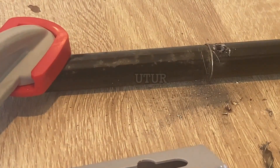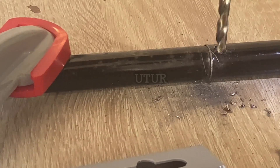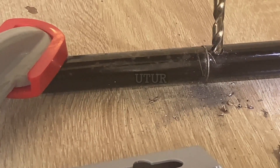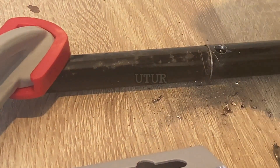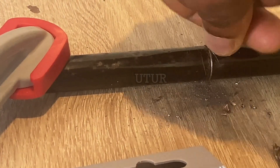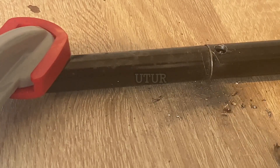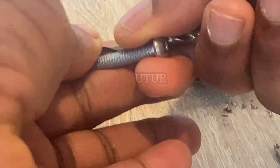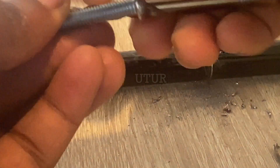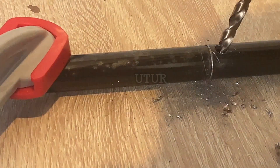This is the 4mm drill bit, then the 5.5mm drill bit. This screw is about 6mm and the hole is about 5.5mm, so I'm not expecting the screw to fit into the hole properly yet. If the screw were a plug it would be a snug fit, but in this case I will be opening up with a 6mm drill bit, as I require this screw to seamlessly pass through both connecting rods.